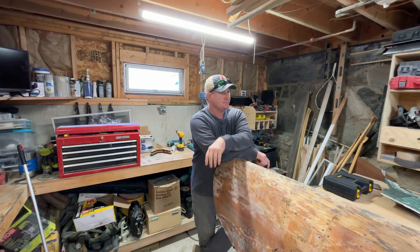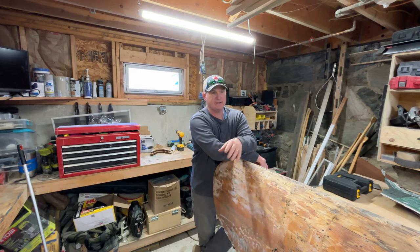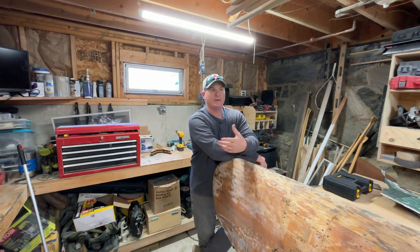That has been removed and it was difficult, just like the rest of it was, based on the fiberglass matting in the multiple layers of fiberglass. This canoe originally started with two layers of fiberglass that was painted, and then there were matting sandwiches installed. On top of the original fiberglass there was matting, fiberglass cloth on top of that matting, then on top of that fiberglass, and then a final finished layer of fiberglass cloth. Multiple layers sandwiched in between had been painted at different times. So what that's telling me is that the canoe had experienced troubles over the years and they added more and more fiberglass.